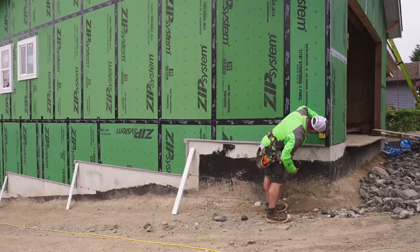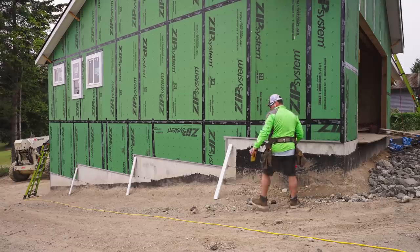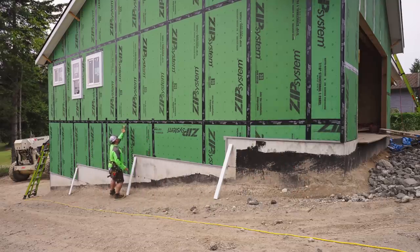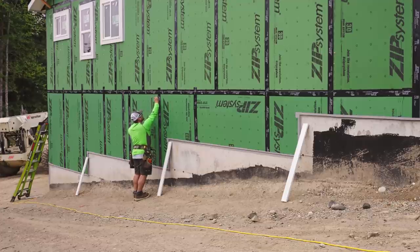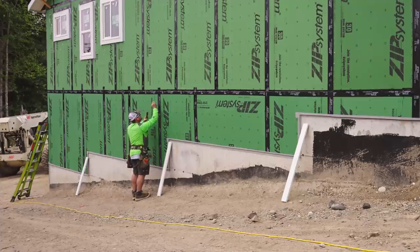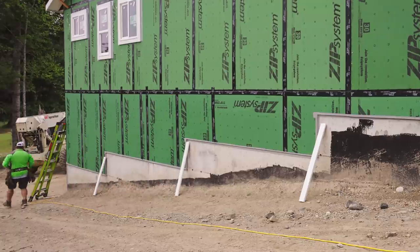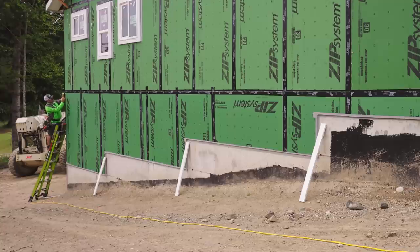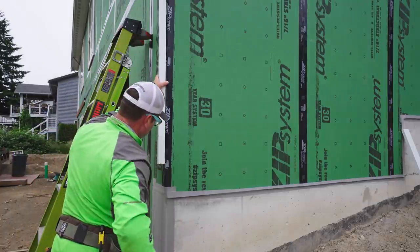Around the side I have to shoot control points. I set up the Stabila LAR 350 rotary laser — the same laser we shot our walls in with below and the foundation grade. I set it on the foundation next door, high enough above that upper step-down so it can serve as a reference across the whole wall. I mark at one end, then go to the bottom of the hill with my ladder. I love the Little Giant ladder because I can legally lean it against the wall on a corner. Now I have control points across the building at three spots.